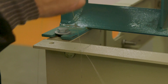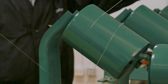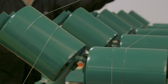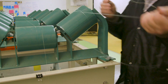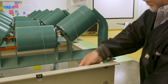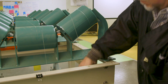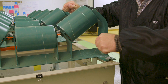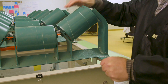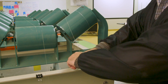Secure one end to the conveyor's structure, then wrap around once on the first idler. The string is then stretched out over all the idlers until the last idler. On the last idler, wrap the string around as you did on the first one and down to the frame of the conveyor. Wrap the string around the frame one time to make it easy to cinch the string to a very tight state. Once the string is tight enough that there is no sag in the line, tie it off to the frame. Repeat this process for the other strings.